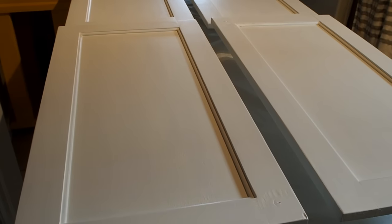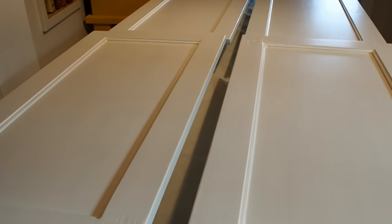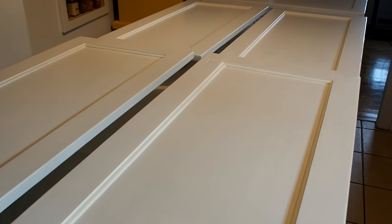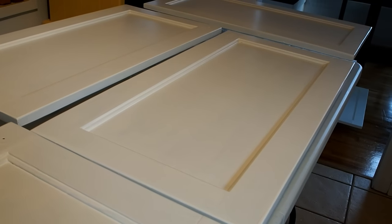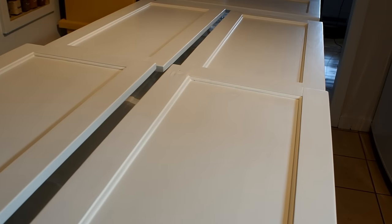We have another coat done and we are almost there — this one looks pretty good. We switched to a foam brush this time. We did a test run each time with a regular bristle brush and a foam brush to see which worked better at each stage. At this point, the foam brush seems to be giving a better coat. If you look up here, you can still see some brush strokes, so not quite happy with it. We've come this far and we have extra paint left, so we are going to do one more coat to bring it up to snuff.